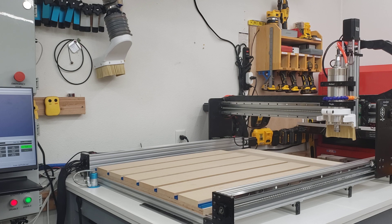The ball screws are roll machined, not ground. That being said, there was one minor defect in one of my ball screws and Bulkman3D replaced it immediately. I sent them a quick video of what was going on and the service was fast — great service from Bulkman. You can see here it has pillow blocks in the ends of the plates on both ends, and what those do is let your ball screws run very freely with very limited drag and friction, which is the goal if you want good speed.